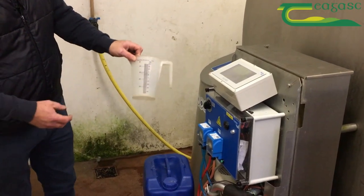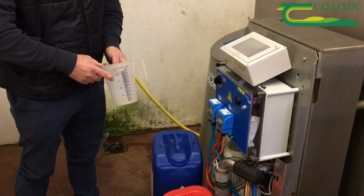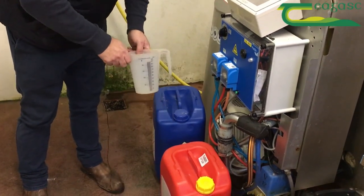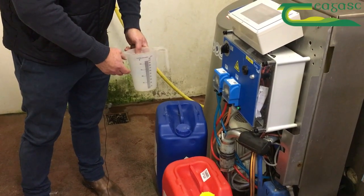Make sure your tank is taking up the appropriate amount of detergent. It's very important that every 2 to 3 months, you get a graduated cylinder, measure out your solution, stick the pipes into the solution, and check whether it's taking up the required amount. This can vary hugely depending on the product you use because the viscosity changes in the product.